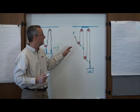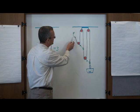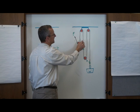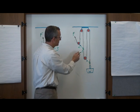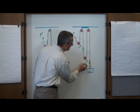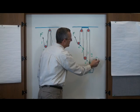In our compound system we have our three to one system pulling on another three to one system. I've separated our block into two single blocks to make it easier to see on the whiteboard. We have our first system with a force of one going in, going through the pulley, a force of one coming out, giving us a force of two coming out of the pulley. This force of one goes through the first fixed pulley, giving us one coming down. Two plus one gives us three at this point, past our friction hitch. The force of three goes to this pulley and comes out the other side as three as well. This three plus this three gives us six, and this final three equals our nine to one mechanical advantage.